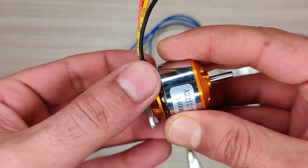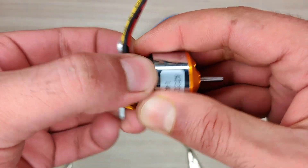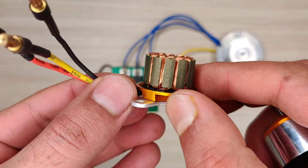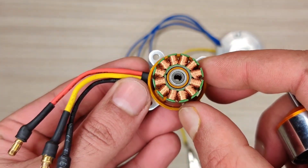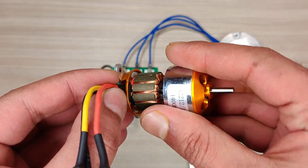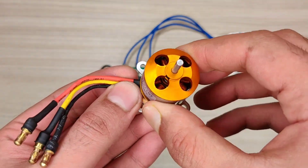About this drone BLDC motor — it comes with three phases called a delta winding configuration, so this needs to be rewound to make it compatible with this circuit. This controller works perfectly only with WYE configuration motors that come with four wires.